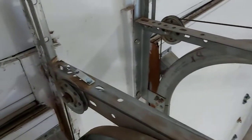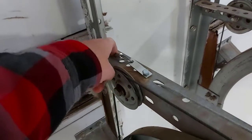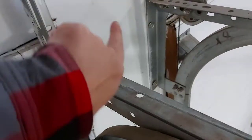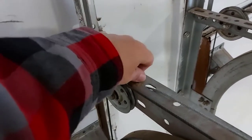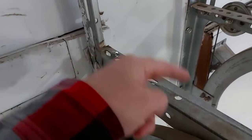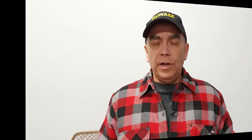I tightened it up so it's not real tight but just taut enough that there's no sag. If your safety cable is way too long, you could cut the end and then weave it through a bunch of the holes — up and down, all around — and it won't let go. My other garage on the property is done that way: no loops, no bracket with a bolt and nut, just a straight cut-off cable weaved through the holes by the previous owner. Once it's weaved through all those holes, it's fine — it's pretty rigid stuff.